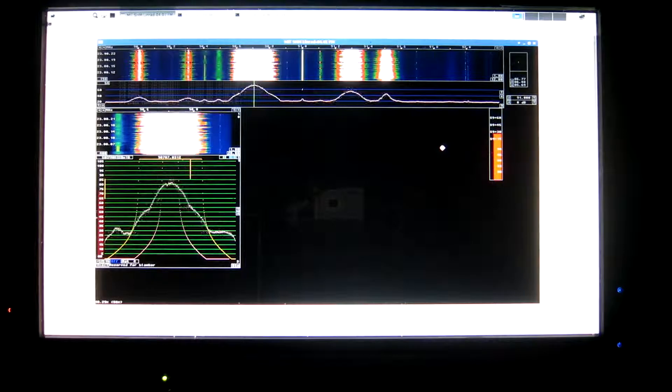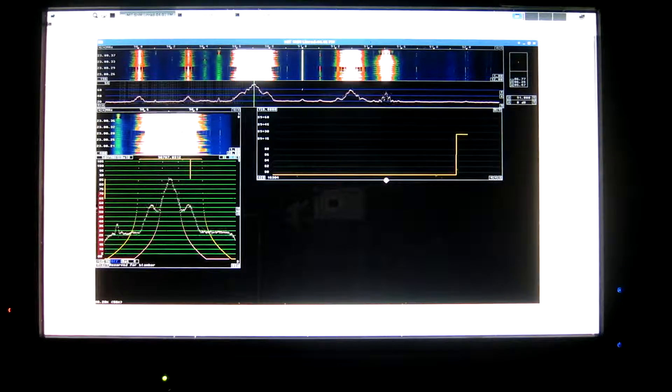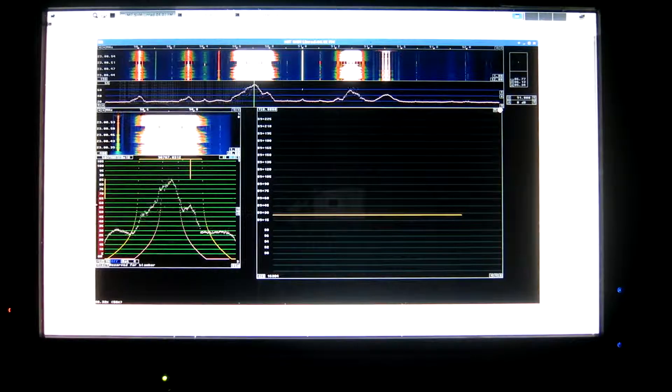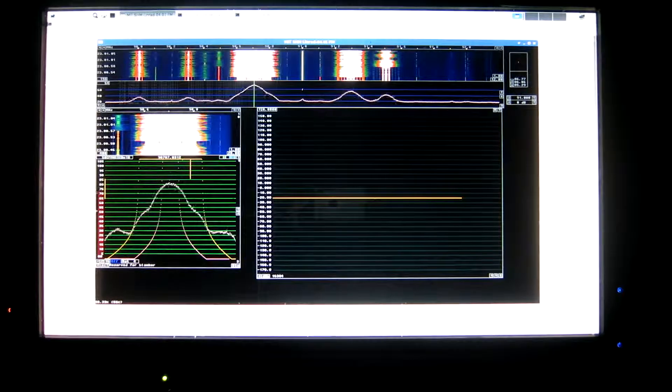The purpose of this exercise is to calibrate in dBm. I take the S meter, which is now a bar graph, and grab it like this and like that. Now you can see it goes from S0 to S9 plus 270. That's not really reasonable, but that's what had happened. I want to see signal levels in dBm, so I click S here, and then it says DB, and now it says dBm.